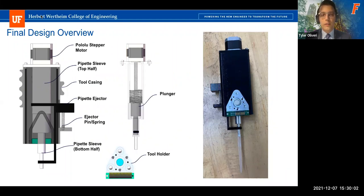For a quick overview of our final design, we feature a stepper motor driving a plunger within a pipette sleeve. Our pipette sleeve consists of two separate parts attached via threads. For our pipette ejection system, we utilize a dowel pin that feeds into a 3D-printed ejection part. This ejector follows the cylindrical portion within the pipette sleeve, moving up and down that shaft to ensure no cross-contamination between pipettes and dispensing modes.